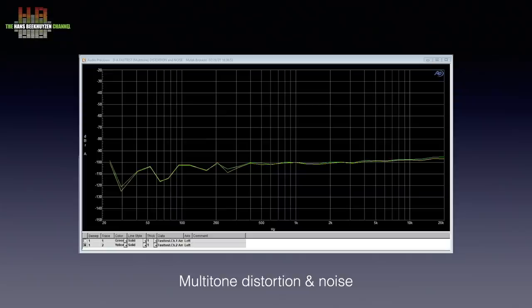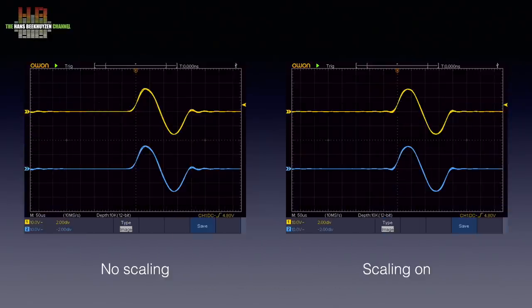When you look closely you see two traces — one measured with the scaler on bypass, the other with the scaler on. Small deviations are insignificant. We only see differences when looking in the time domain with a single sine pulse. The non-scaled version shows almost no pre-ringing, which is a fingerprint of DACs that use the MQA filters. When scaling is on, you see slight pre-ringing due to the filtering used during upscaling.